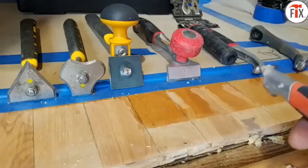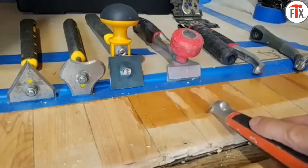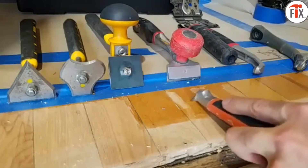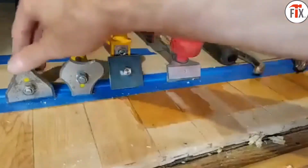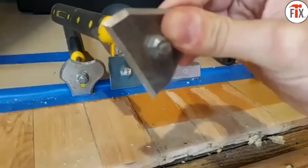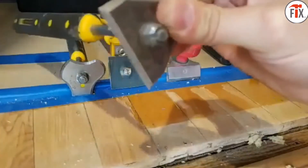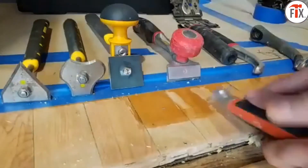The small one can actually be faster even though it takes smaller bites, because it strips off the paint quicker. It gets into all the inconsistencies that the flat wide one won't get — the wide scraper is kind of like a straight edge, so if your wood isn't perfectly straight it won't take it all off. The narrow triangle blade gets into all those uneven spots.